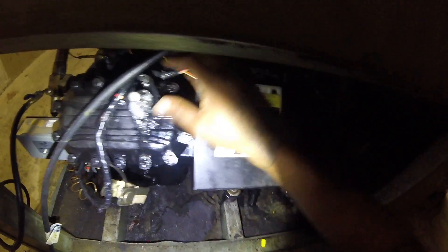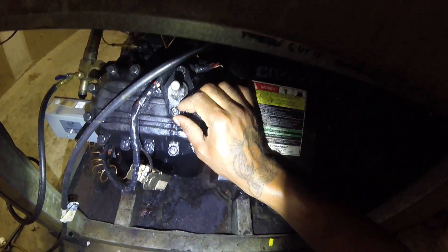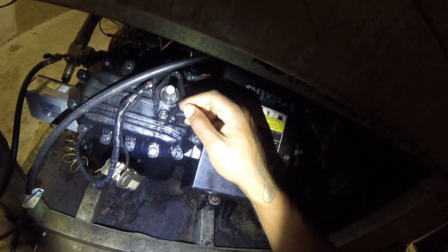But I've never repaired a leak at this solenoid before. So leave a comment and let me know what you would do. I'm thinking I'm going to have to take this off — I don't know if I'm going to have to get another one or if there's a way I can tighten this up. But I think I can get a screwdriver and tighten it up, going clockwise. I'm going to try that and see if it will stop the leak. You can see it leaking real bad — this is soap and water right here. So leave a comment, let me know.